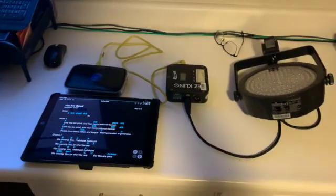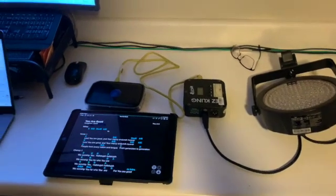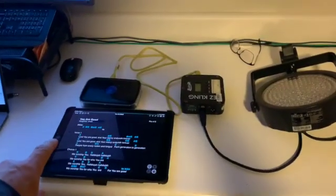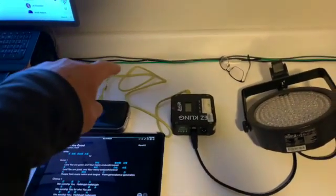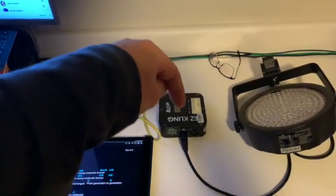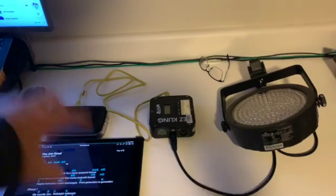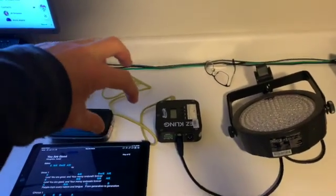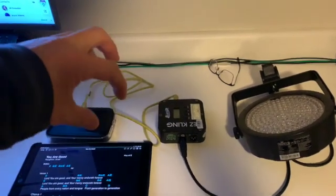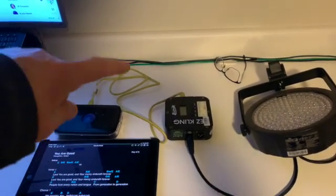The way it's being asked about on the forums is: will the DMX AN2 work? It would, but what you would need is something like a camera kit converter on the iPad to take it to something that converts it to ARTNET signal, ARTNET signal into the AN2, and AN2 into your lights. So there's a whole middle piece that you wouldn't have if you just had the DMX AN2 — a whole middle piece that doesn't exist. You're going to have to figure out what that is.